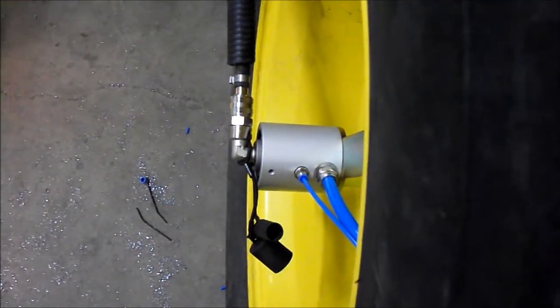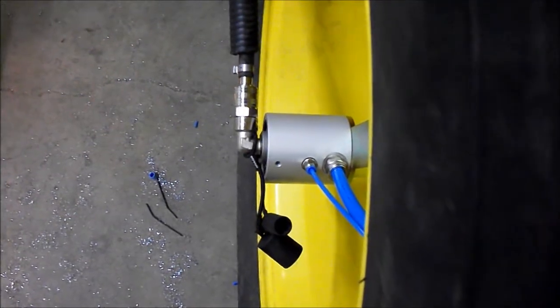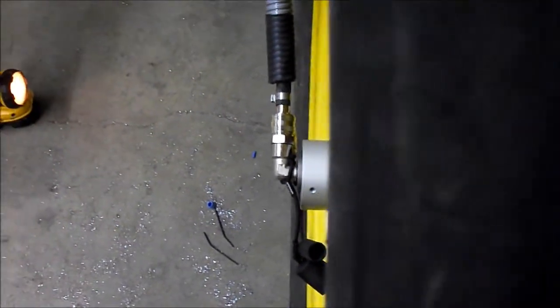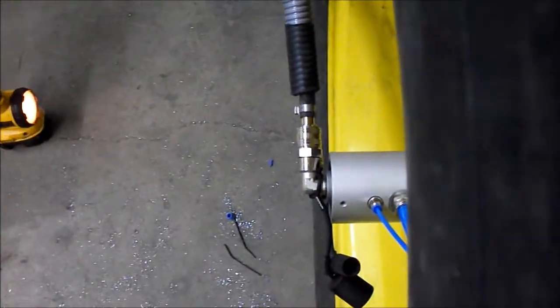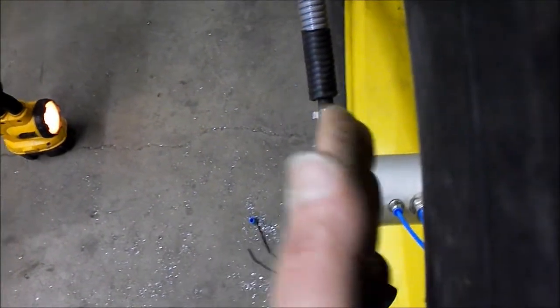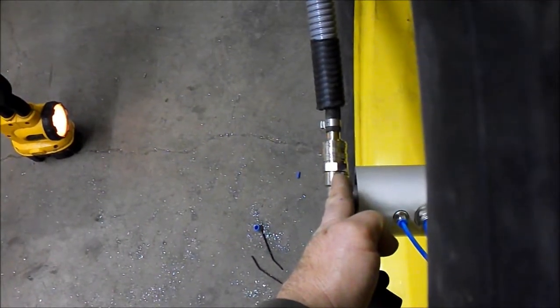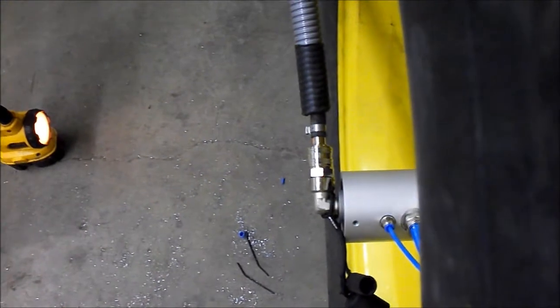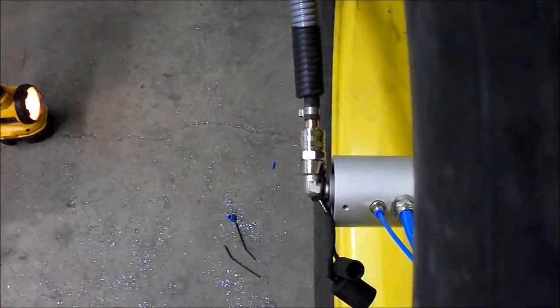The line of thinking here on the length, the 5 3/4 inch length, which worked for this planter, and the amount of offset in the wheels, is when we're looking at the edge of the wheel, the hoses are just outboard of the straight line between the beads by at least a 1/2 to 3/4 of an inch, as much as an inch. We didn't want too much sticking out past here because of the mud going by if they get stuck.